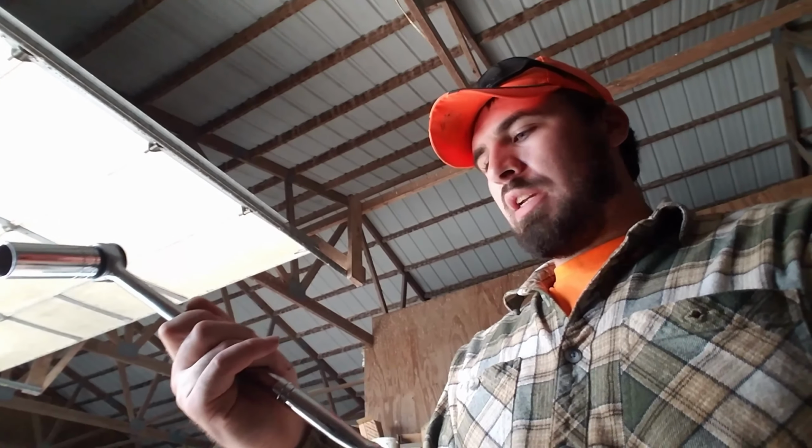Now, another thing I bought at Fleet Farm. Probably didn't need this. All I needed was a 24 millimeter wrench. All the head sprockets for tightening the chains on the head on the balers are 24 millimeter. I was hoping they had a 24 millimeter wrench with a longer handle, because usually I have to use two wrenches just to crank them good and tight. I ended up buying this, I think it's like a 14-inch handle socket wrench or ratchet wrench. So yeah, we'll see how this works.